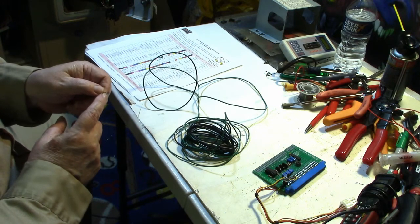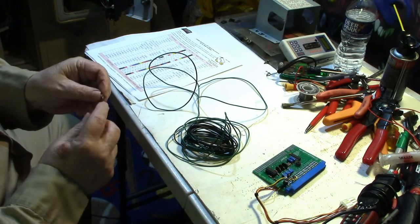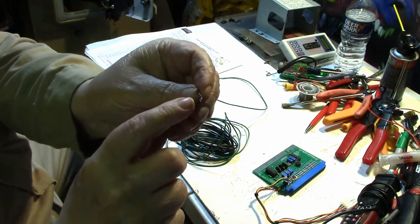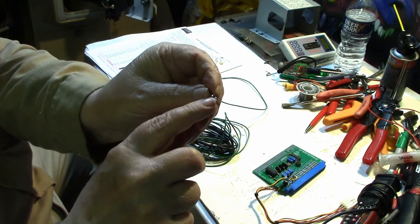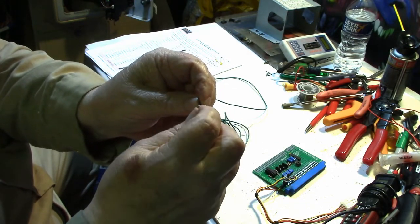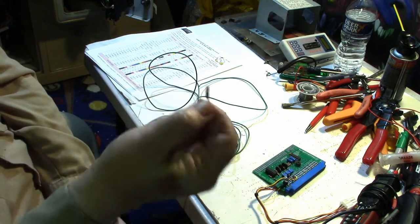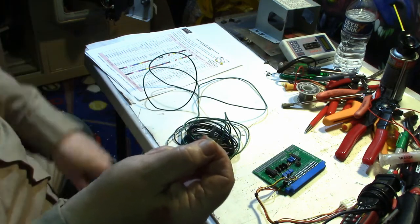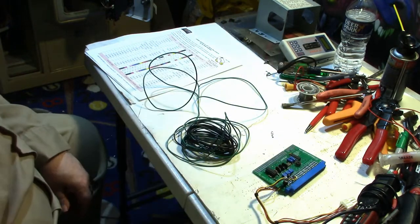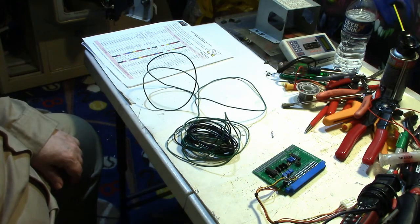And it's such a small crimp where the wire crimps, I'm not going to be able to get that loose. But where the insulator is, right here, I ought to be able to open that up. So what I think I'm going to do is solder the wire onto this connector and then recrimp the insulator for the strain relief. And then I'll put this in the connector and wire it up to the power supply, because the power supply in the game does have -5 volts. For whatever reason, they never wired it up. Okay, so let me go do that, and maybe I'll bring you back.